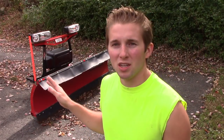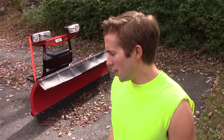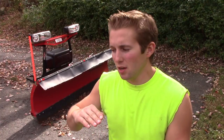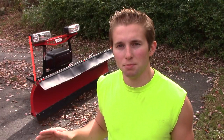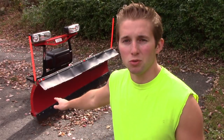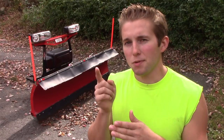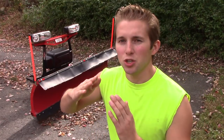Let's start with snow shoes. When I bought my plow, a Western HTS, it did not include a shoe kit. I think I spent maybe around $200 for the shoe kit, which I've used maybe a handful of times. Some people choose to lower their shoes when plowing a lot of pavement, maybe big open parking lots, because it does help reduce wear on your cutting edge — it wears down on your shoes as well.